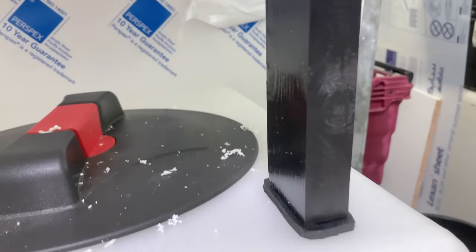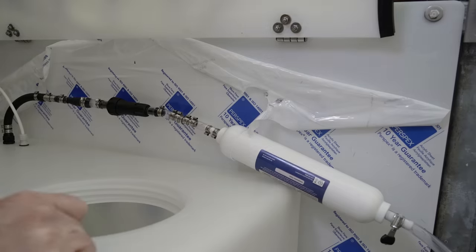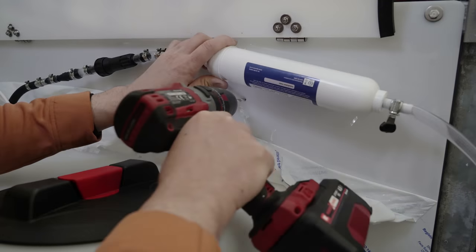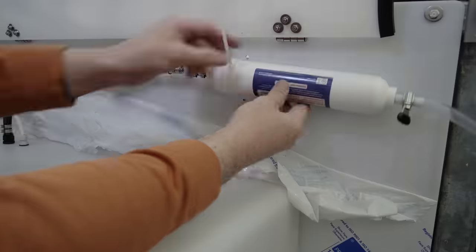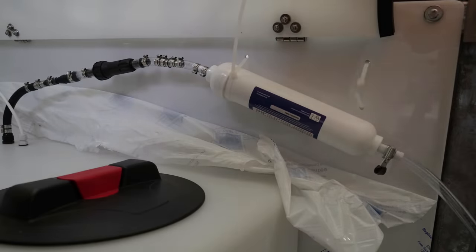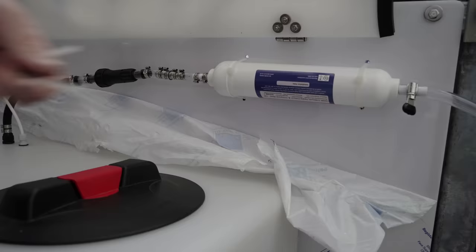It means I can clip everything together. First, the nitrile hose onto the top of the cupronickel standpipe, and then somewhere to mount the larger filter. There's enough rigidity in the sequence of fittings for those two solid points to keep it still, but I may add a Munson ring halfway along. A note of caution, I've not really used acrylic before. It's more brittle than polycarb, ABS or polyethylene, and I caused a slight star crack whilst drilling one of the holes. But the main rig is in.